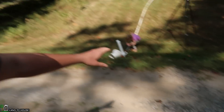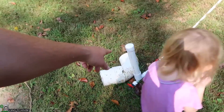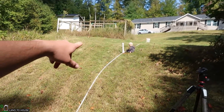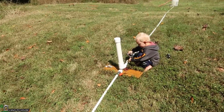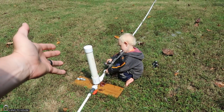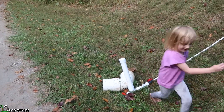I spent a little time trying to get the two to cycle together. This one's doing better than I expected. I never thought this one would have enough water to cycle, but it did. The problem is that one up there — as soon as you try to cycle it, the pressure is sent downhill, operates this one stronger, and that one up there is never able to actually start cycling. So I think that's going to be our issue with these two pumps, at least with the same size. Maybe if I were to step this one up to an inch and a quarter, it would have enough water coming down to cycle that. Maybe it would add more pressure to the second pump as if it were going to have more head pressure, which could increase the lift potential. I'll have to revisit this with a bigger pump on the first stage.